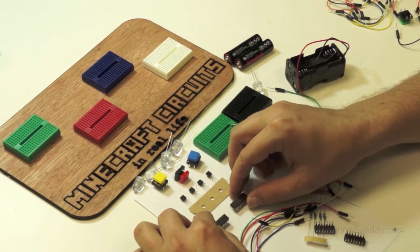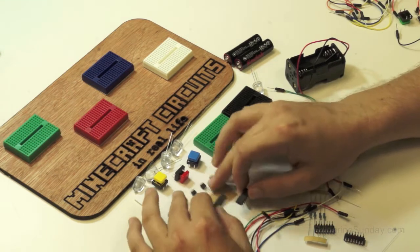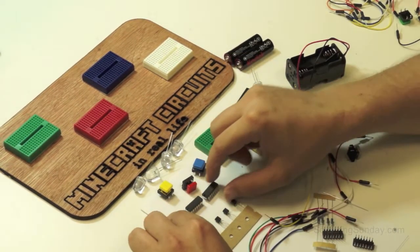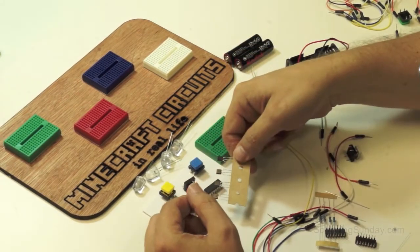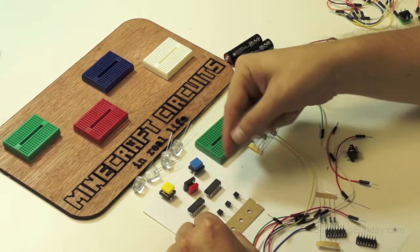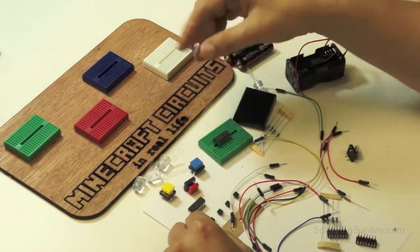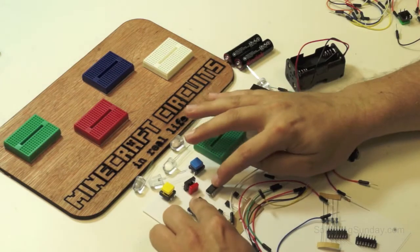And then we're going to introduce a very interesting chip, the 7400. The 7400 chip is basically what they call a quad NAND gate. So we're going to go all the way up to this package, and inside of this package are a set of transistors and other bits of electronics that have been shrunk down. So you can't see inside, but we end up wiring those up on our breadboard and then powering them appropriately, setting up the LEDs, and now we're actually doing arrays of logic gates.